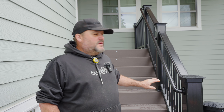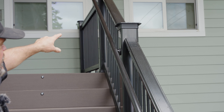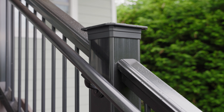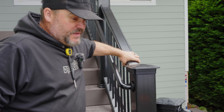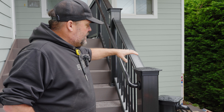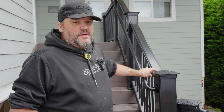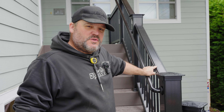The building inspector was fine as long as we terminated our handrailing on each side into the post. As you can see, the middle of this railing run has a center post that protrudes through the top of the rail — so this is not considered grabbable or graspable. It's too big, too bulky. It looks good, but you can't grab it, and it's not continuous.